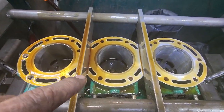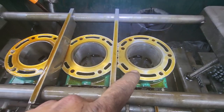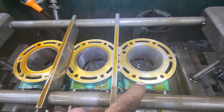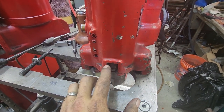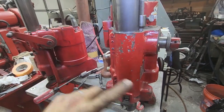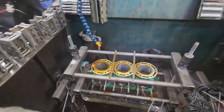This is one of the issues you can get with some of these cast cylinders. This cylinder was bored I think 25 over before this failure already, so my guess is the person that bored it last time had it a little farther off than they should have — or it could be that the casting itself was off; I've seen these be pretty far off when they get cast. Some table-style boring bars where they bore from the top down using a centering cone are really not that accurate. These fingers will get you within a thousandth of an inch, which is why I prefer this style boring bar over those table bars. They work better and are far more accurate. Let's get to honing and get this thing sized.